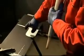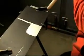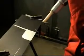Depending on what you're cleaning and the type of substrate underneath the dirt, it could be damaged by what you're doing, especially if it's something very delicate. So the trick is to start from a fair old distance, 150, 200 millimetres away from the surface you're cleaning, and then move in until you can actually see it start cleaning. If you can see it start cleaning and there's no damage being done to the surface, go a little bit closer. Don't go any closer than about 60 millimetres away from the surface. 60 millimetres is about the optimum cleaning distance.